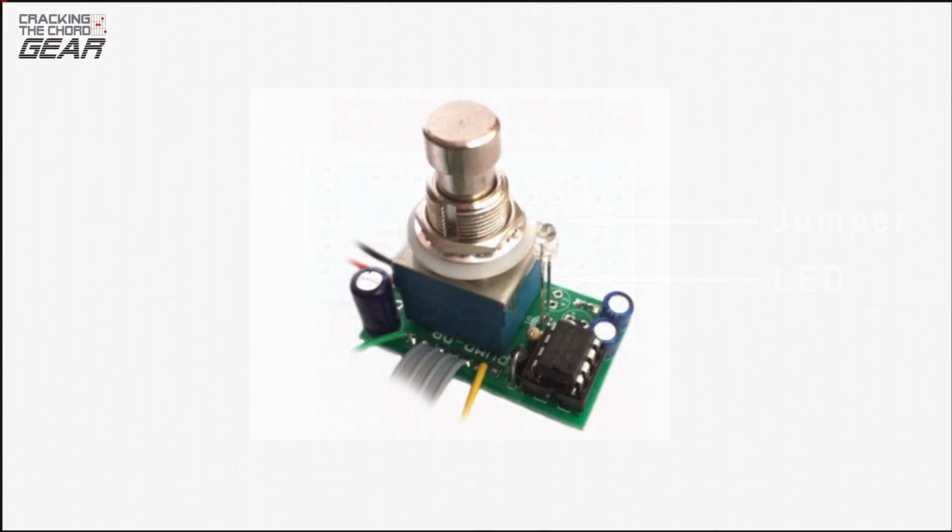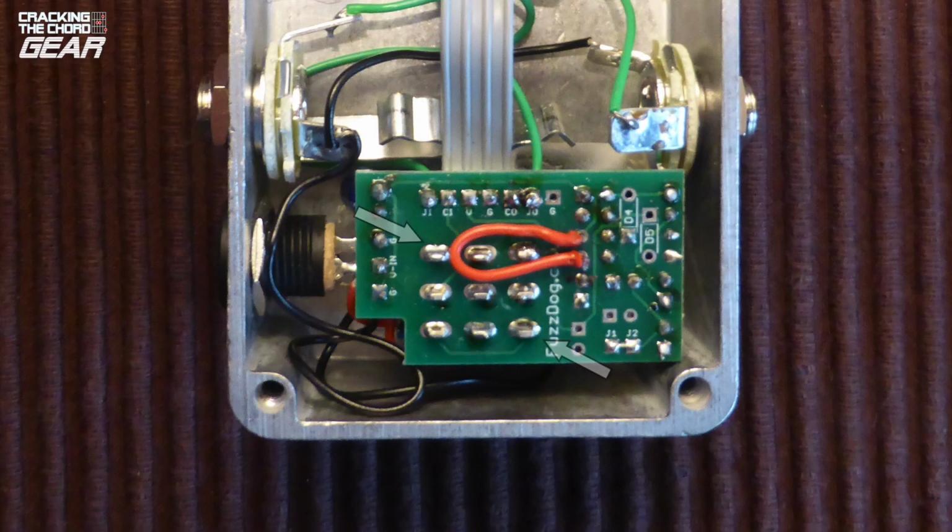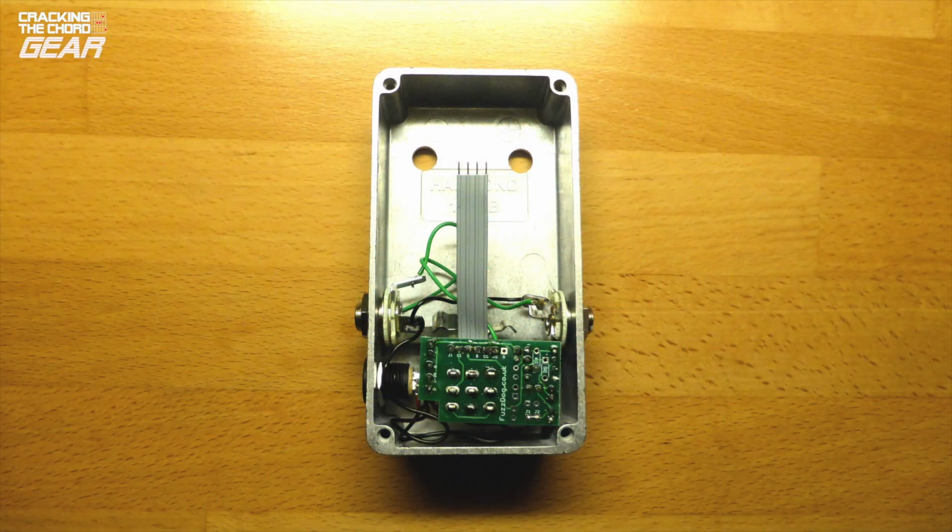Then came the push button switch, which is really easy. You just have to make sure that you keep it flat to the main board, tack it in place at 2 corners, and then solder in the rest of the connections. I then soldered in the leads connecting the board to the power socket and the in and out sockets. It required a magnifying glass to identify which pads to connect which leads to. The fact that you were dealing with positive earth transistors induces a degree of fear, I have to say. But you've just got to be patient and work through it all logically.